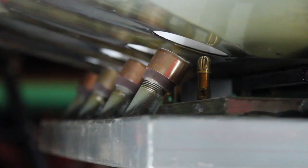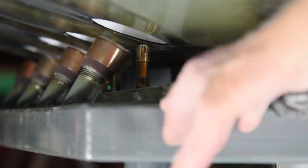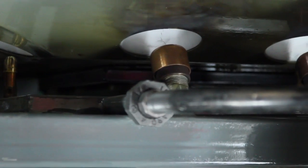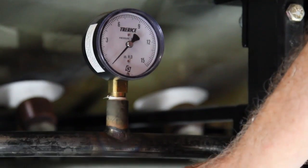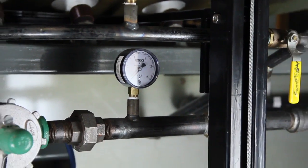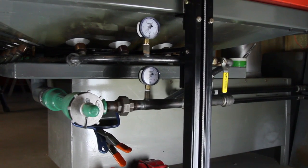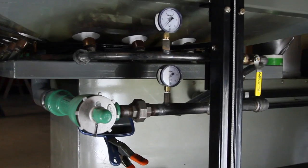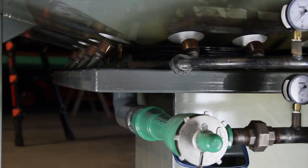The pressure and gas volume going in is gauged here. You actually have two manifolds: a pilot manifold and the main burner manifold. This reads the amount of fuel in terms of water column inches going into the pilot, and this reads the main burner. All of this is hooked up to a flow volume meter so the amount of fuel used for each firing can be calibrated and recorded — so you know exactly how much fuel you're using and the cost of each firing.